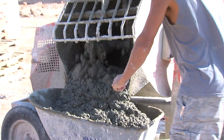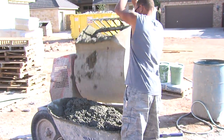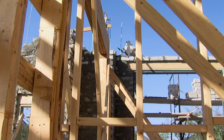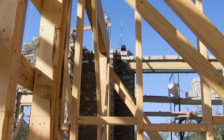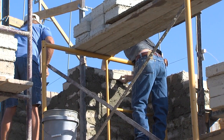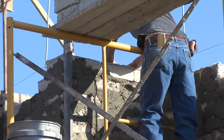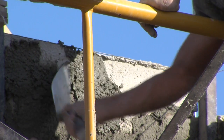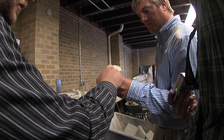We're very adamant that there's no cardboard in this particular mix, no wax papers — it's just what we found worked best for blending the cements and all the additives into our products. Compared to a standard cinder block, we're about a third of the weight and twice the strength. A standard cinder block has an R-value less than one; ours is about R25 in that same size unit. It's really the first pre-insulated cinder block, and it's made out of a recycled material.